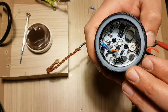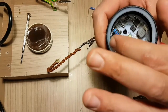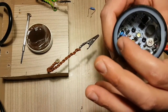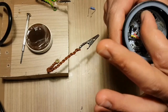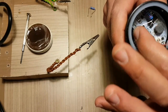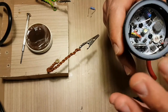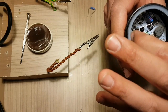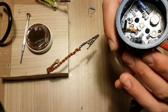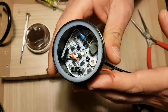Here it is — the resistor is soldered onto the C1 capacitor. Leave it on as high as this, you don't need to clip the extra wire so it has space. Just lean it back and do with the capacitor whatever you want — you can put it on the side like this. That's pretty good so it doesn't get in the way of the light or anything else.